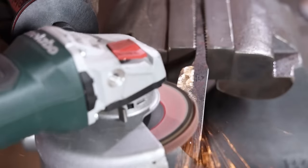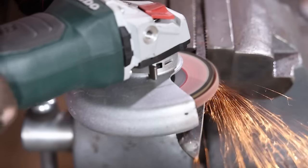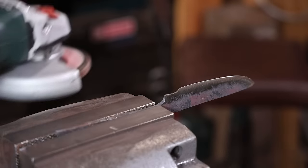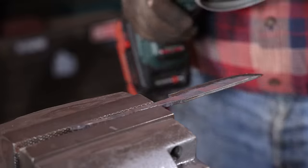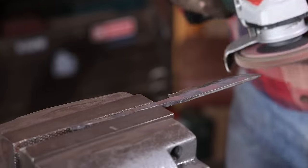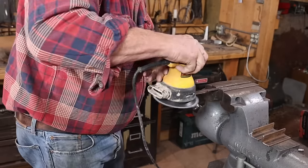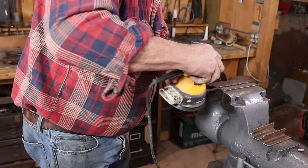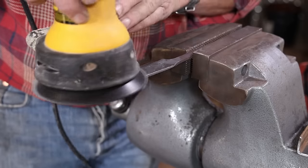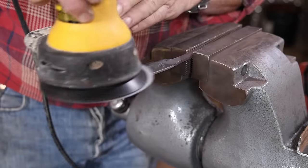After using the hard wheel initially, I'm using a flap disc — a 60 grit flap disc and then on to a 120 grit disc. Those are just what I have on hand. The angle grinder also runs much faster and it's an easy way to overheat the steel after it's been hardened and tempered, so it's not the best tool once hardening and tempering has been done. A little random orbital sander, on the other hand — I have finer discs, up to 320, and it runs at a much slower speed so the risk of overheating the blade after hardening and tempering will be much less. So when we get to that point, I won't use the angle grinder, I'll just use the palm sander.